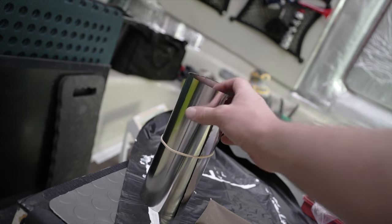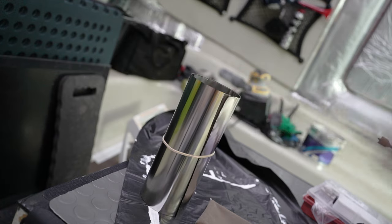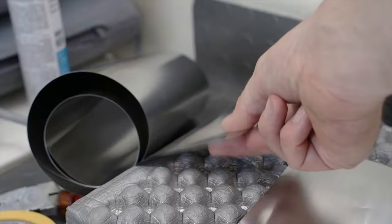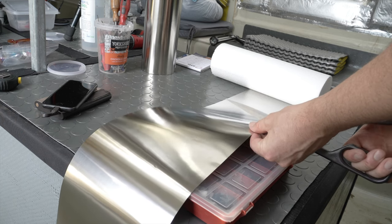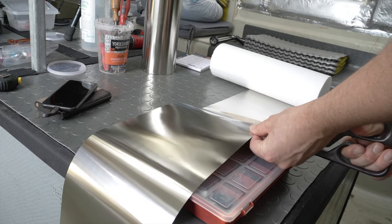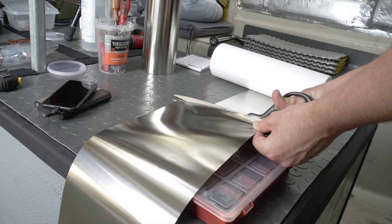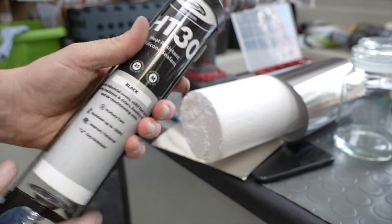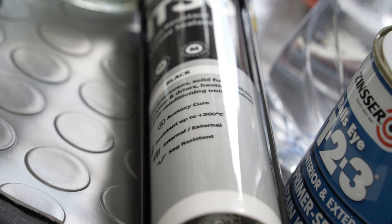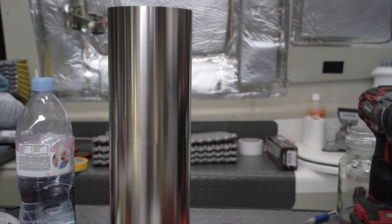I'm using it as a corrosion and heat-resistant internal liner to the hood. It's stiffer than foil and holds its radius nicely without crumpling, plus it cuts with a good pair of composite shears I no longer use to cut Kevlar fabric. I'm forming the layers of my hood around cylinders of polystyrene at the correct diameter for my stove chimney, and to keep everything fixed together and in shape, an extra heat-resistant silicone sealant. I've made four of these steel-wrapped cylinders: a central vertical, the cross-branch, and the two side verticals.